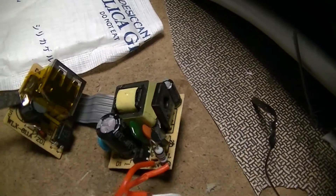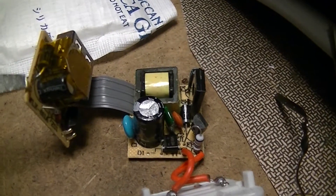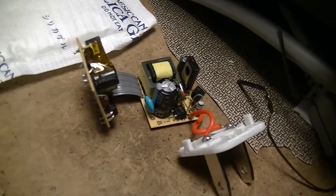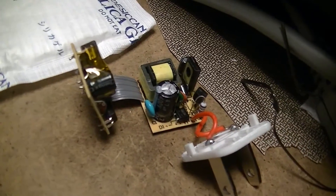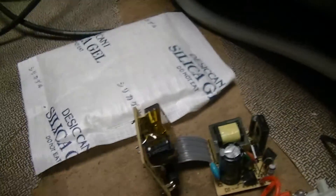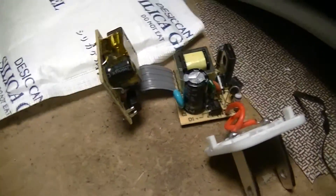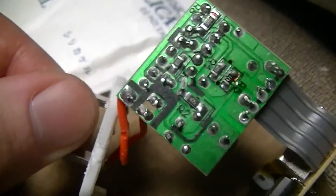The PCB looks to be a hybrid of about 30 to 40 mil thickness — hybrid fiberglass and paper laminate. So it isn't quite as bad as some which are just pure paper PCB, but you know, still rubbish. And on the underside of the board there is absolutely horrible clearance and creepage — none whatsoever. Don't trust these things; they're crap.